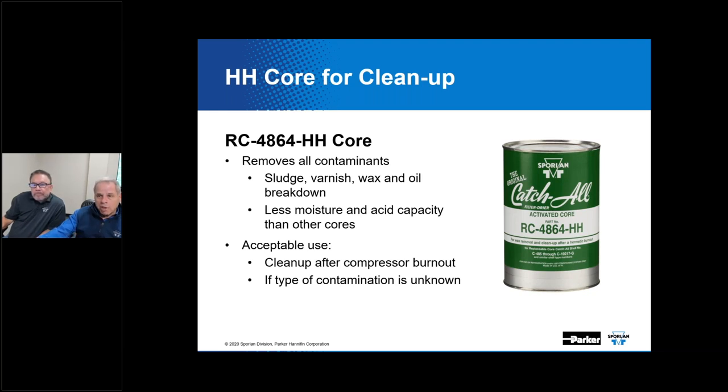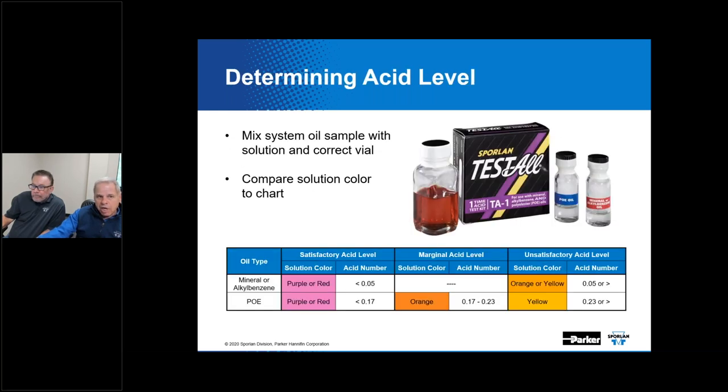Okay. All right. Well, don't let me get away without showing the cutaway of a filter dryer again unless there's other questions that come up. One of the things that we mentioned before is the presence of acid in the system. And it's, well, how do you know if you have acid or not? And one way to take a look at that is if you can access an oil sample. We have acid test kits that are available to do an on-the-spot quantitative test. It's not as perfect as a full-blown evaluation by a chemistry lab, but it gives you an overview of what's going on.